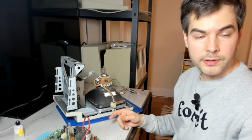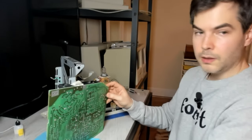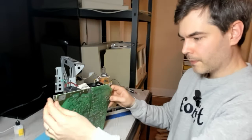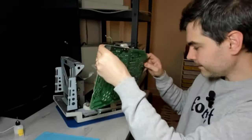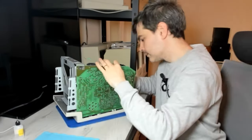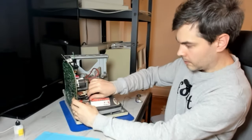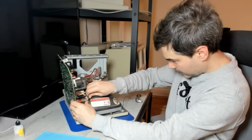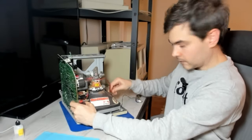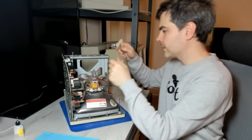So in order to test, it's important that we hook everything up. Everything is needed in order to have a functioning computer. I'm not going to reattach the insulation sheets, but I will be very careful not to touch anything here while the computer is running. So we connect the CRT back. Connect the anode cap, just angle it in there into its little hole, put the logic board interconnection cable in,